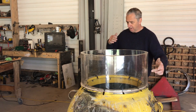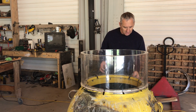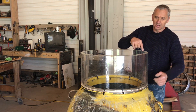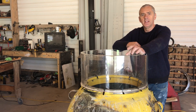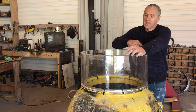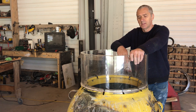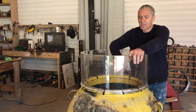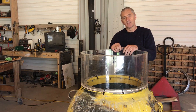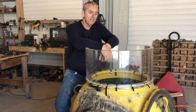That one's a little bit loose but still snuggish, really snug, less snug, and looser. So now I know this area from here to here needs to come down — it needs more sanding. Eventually each one of those ribbons will be very tight, then it's right on the money. I'll use more ribbons so that I don't end up with a little sneaky high spot somewhere. That's my secret weapon for getting this right on.